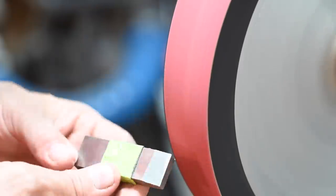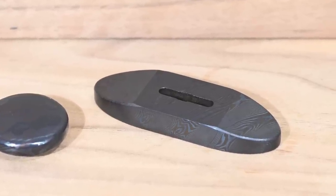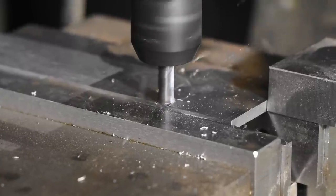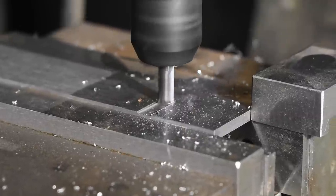This cross guard will seat where the blade meets the tang, so the first thing we're going to do is mill out that little area so that the cross guard will seat nice and cleanly against the blade.